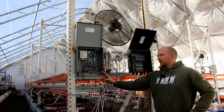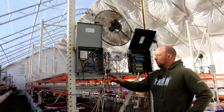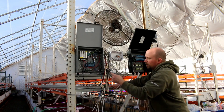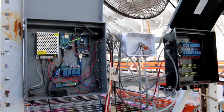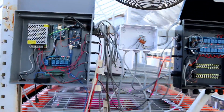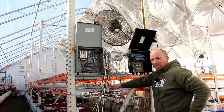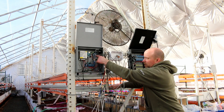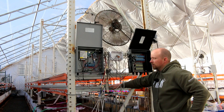We have two boxes: a low voltage and a high voltage. This is 120 volt, and this is 12 volt over here. Inside our 12 volt system we have a wireless control unit I call the master, and a slave unit that's not wireless but connected via I2C, which is a network protocol, to the master unit. The master unit is responsible for all the thinking - it figures out what the sensors say, talks to the server, gets its instructions, and sends commands to the slave unit which has all the inputs and outputs to control everything.